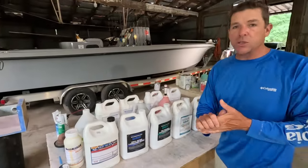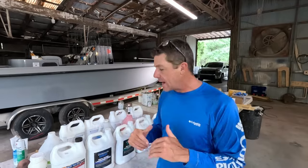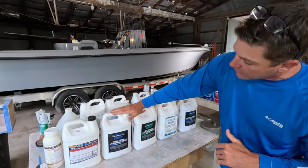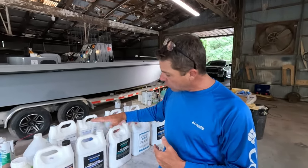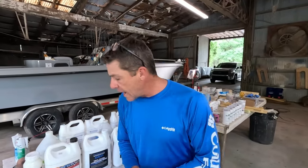One of the most common questions — or things there's some dispute about — is when can you put epoxy over polyester and which ones are compatible. All of the polyesters and vinyl esters are compatible with one another. You can put epoxy over the top of vinyl esters and polyesters, but not vice versa. So if you've got a fiberglass hull boat and you want to put an epoxy barrier coat on it that's totally fine, but if you use an epoxy putty for the repair you don't want to put polyester resins or gel coats back over the top of that.